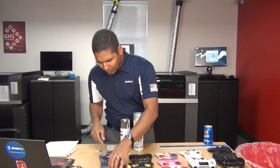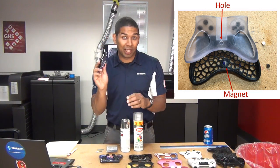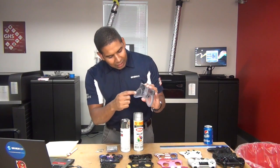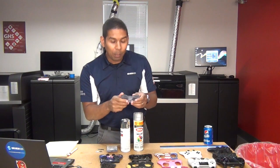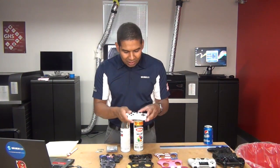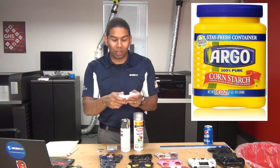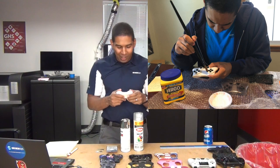I've seen people get some really neat results that way. One of my favorite tricks is magnets — use the magnets you buy at your local hardware store. The back covers were having trouble attaching to the main body, so you can see I put a little hole in with a little magnet there, and now it snaps into place. You can also do some weight control — I've got some pockets in my part so I can glue pennies or lead in there to make the part heavier if I need a more realistic weight. In this case my parts are too heavy, so I actually put the pockets in there to lighten them up. One thing we learned doing this specific project was that Agilus coming off the tray is a little tacky. So if you want to make it feel more like leather or buttons, get some cornstarch and a brush and just put a light brushing of cornstarch on the parts — that'll smooth them out and make them less tacky.